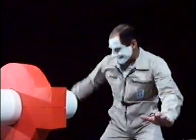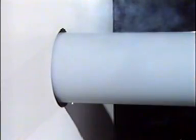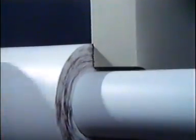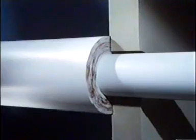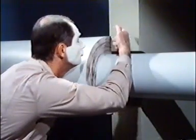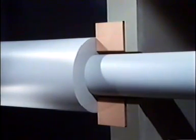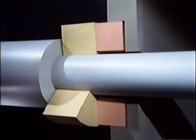But will the seal withstand higher loads? The seal starts leaking due to wear caused by friction. The shaft and housing are far too expensive to be used as wearing parts. Ideally, only the seal faces should be changed. A stationary seat at the housing, a seal face on the shaft. Exchangeable wearing parts make it possible to optimize the various available materials.